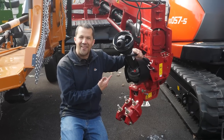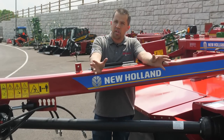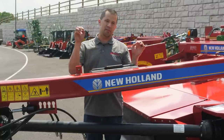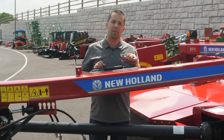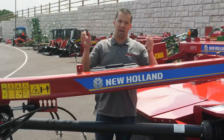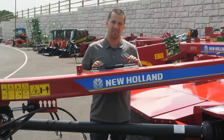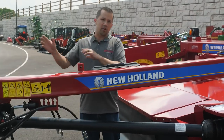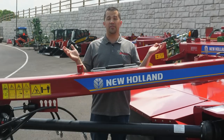These other mechanical solutions are part of the reason I struggled to find a CV joint out here today. Understanding the differences between these PTO shafts is important when shopping for equipment, because the differences can literally have hundreds if not thousands of dollars of impact on cost. A deluxe implement with a CV PTO shaft may have a lot more value in those dollars than a less expensive one using yoke joints — and it may or may not be right for your application. Our sales staff is here to help you understand whether you're getting value out of that more expensive shaft for your needs.